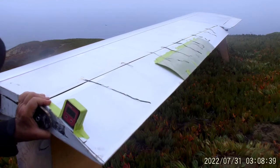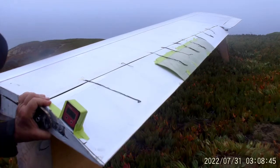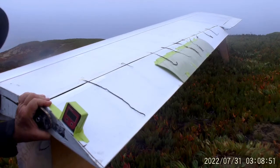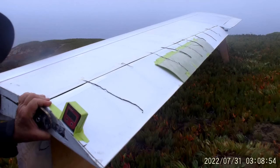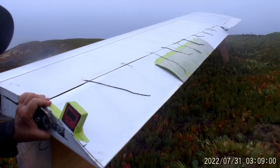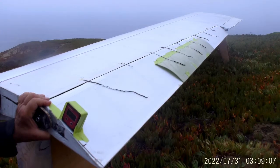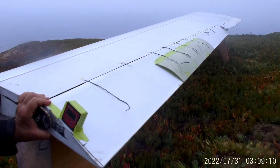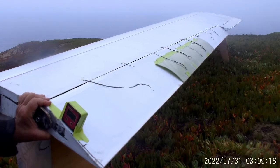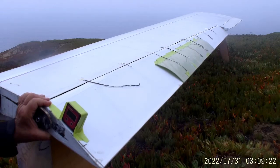We're doing pretty good here. There's 20 degrees and it's staying pretty well attached — that's fairly impressive. It's separating out here at the tip. There's 22 degrees — staying relatively attached over the lump, and definitely attached inboard. Big improvement. That means I'll maintain linear control throughout the full range of control surface deflections, but we still don't know if I'm going to have enough control power, enough roll rate — and that'll be determined next time I go fly it.